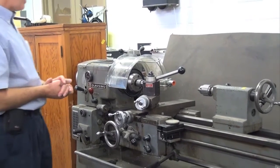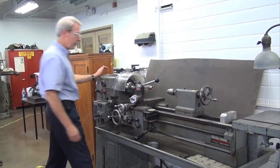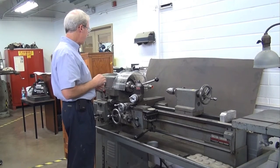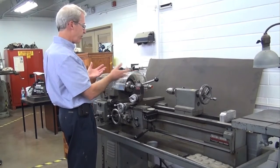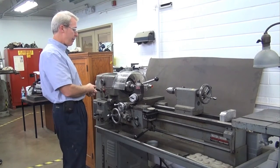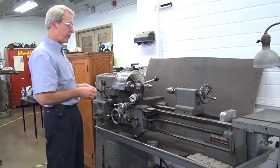There's no task light here, so when looking at the electrical — electrical comes into the machine. In the back there, you just want to take a quick look. Remember, our power is off — we would cut the power at the disconnect switch on the wall, and then we would look at that electrical feed coming in to see if it was deteriorated, has dry rot, this kind of thing, and the connection on the back of the motor and the housing — make sure that that's intact because you don't want to have any kind of shock hazard associated with your electrical power.